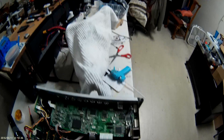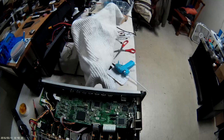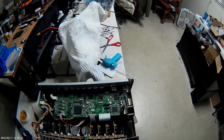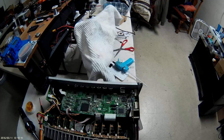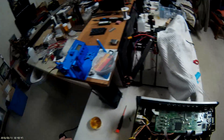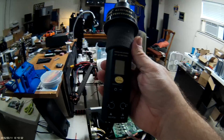You do not want to touch it or move it at all while it's hot, because you'll smear the solder and short it and you'll never get it right again. This is done by machine from the factory. You cannot change the solder balls underneath it — that's a real pain and it's done by laser-operated micro machines.